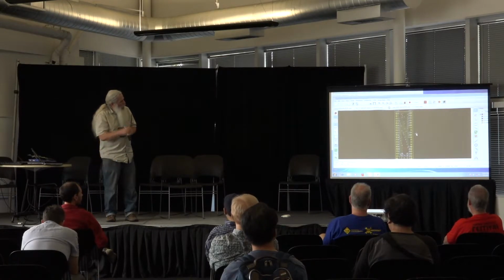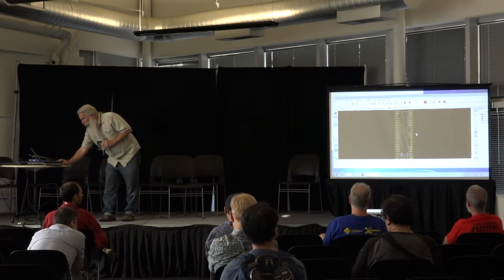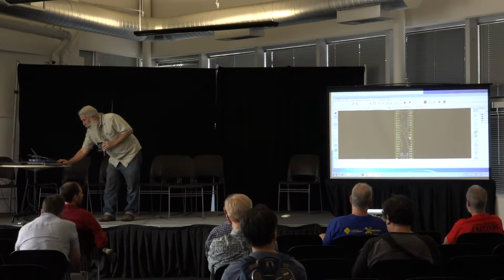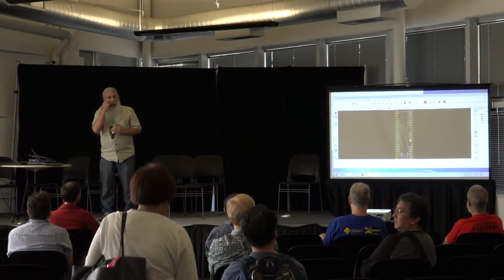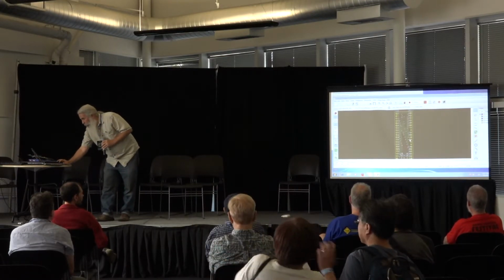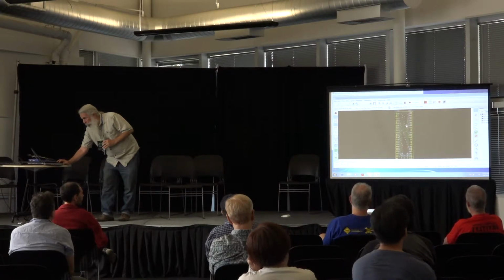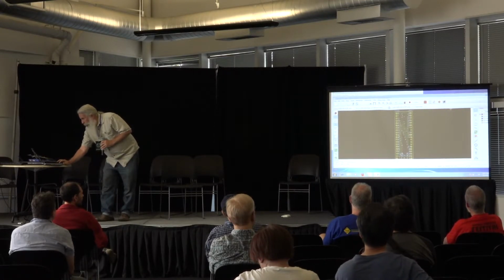And so this is the board that you can see here, the number of oddball things that there are on that. These holes that are here next to the outside pins are the actual holes that I use to interconnect from board to board. So those are what they call interposer connections. And I tried to put most of them along the sides, so that they don't take up any routing space between the pins and things of that sort, because I need those as well.